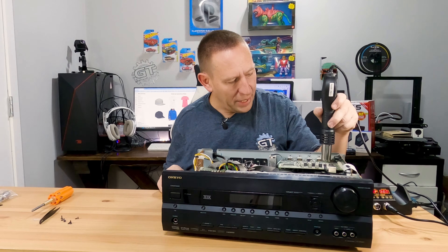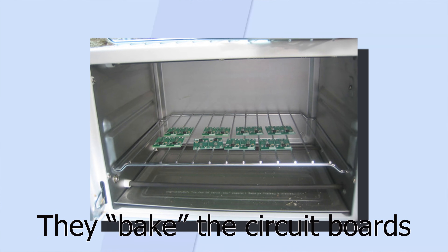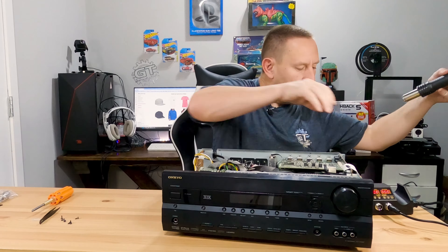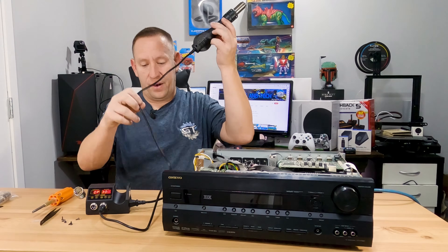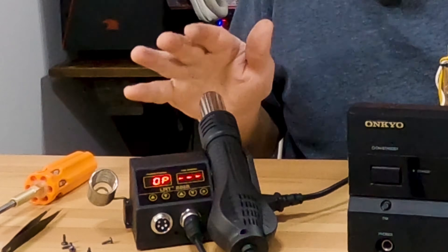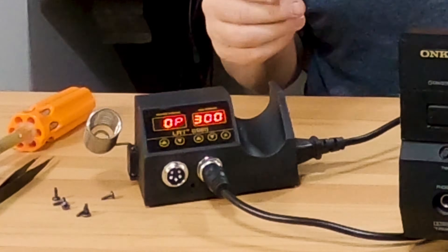These boards are usually baked — they can handle the heat, so don't be worried. This is why some people say to fix electronics you can just throw it in the oven at 300 degrees for 10 minutes, and that might work too. That's not what we're going to do in this video because I didn't want to take all the plastic connectors off. One other thing I just noticed: if I lay this down on here, it goes into cool mode — it actually stops heating and just blows air to cool the tip, then shuts off. So when I pick it back up, it'll start blowing at 300 degrees at the fan speed I set.